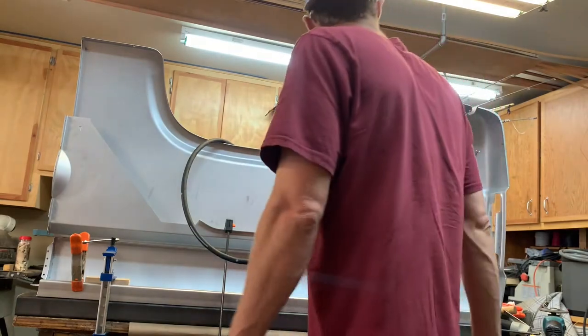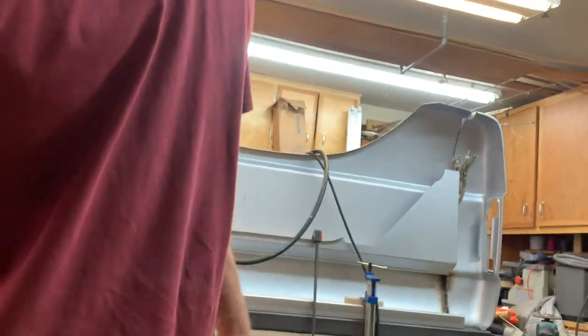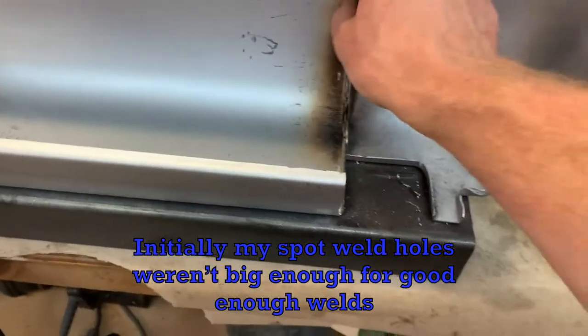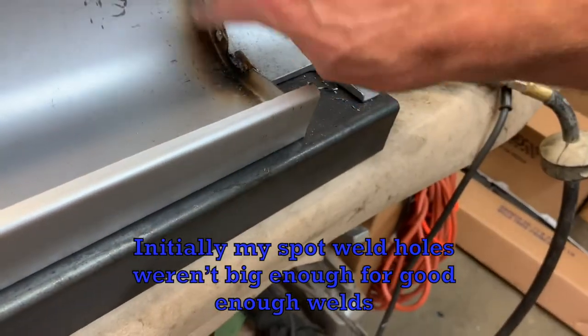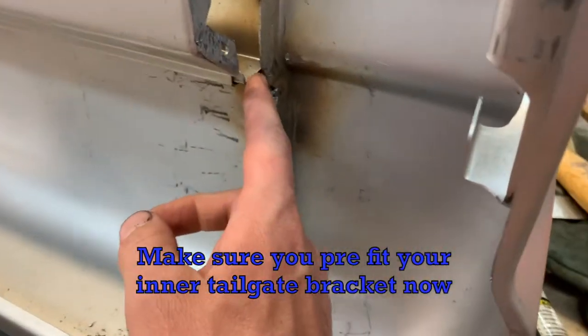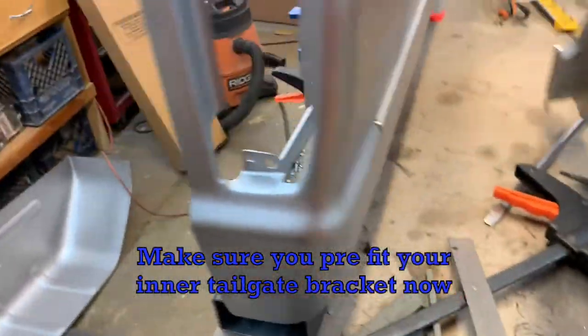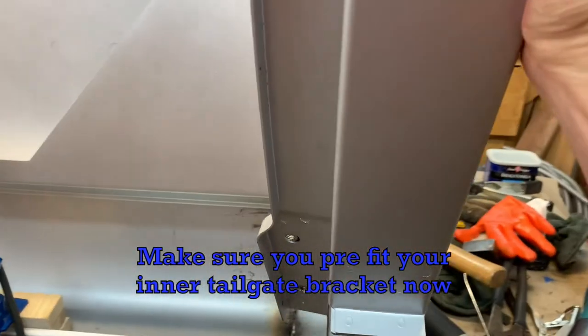This is what I'm building right now. The hardest part is this back corner. Right here I was just testing my spot welder — as you can see it's not that good. I had to cut it down a little bit and redo them because I wasn't at the right temperature. There's a little slot here, and that's where the tailgate slides in.